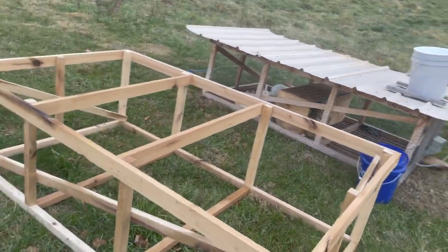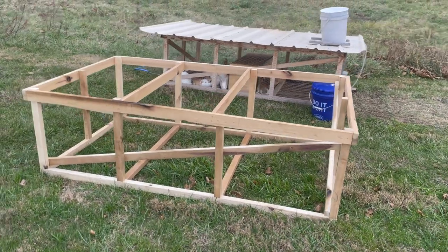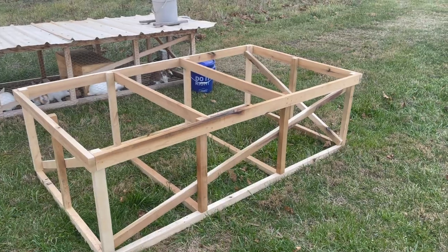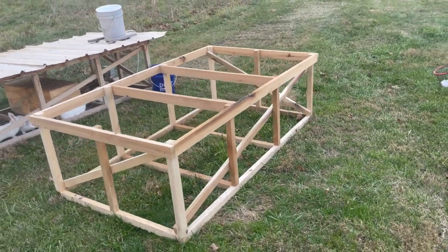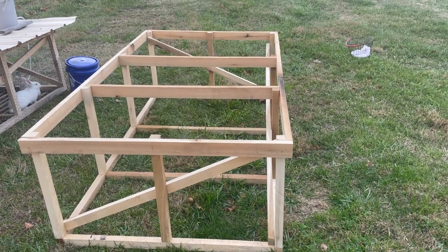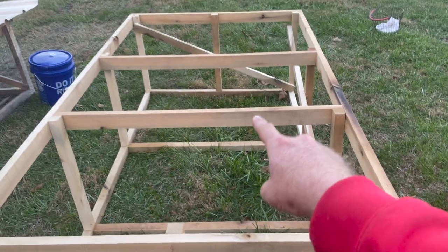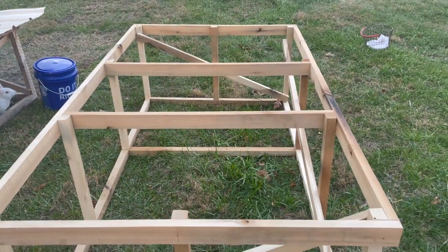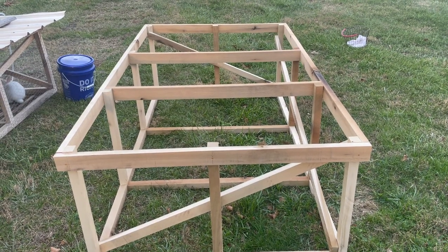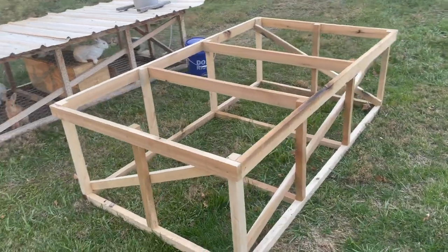The first thing is that this design calls for nominal lumber. So I went to a sawmill and got poplar, and when you get lumber from a sawmill it doesn't always come in exact sizes. A two by six might be a one and seven-eighths by five and three-quarter, or maybe even a little bigger. What's awesome about this design is that the only pieces where the length really matters — that have to be adjusted if your pieces aren't exactly the right size — are these top four pieces.